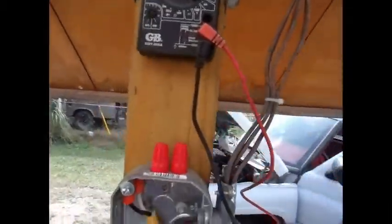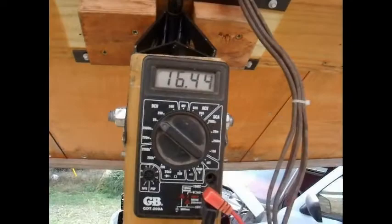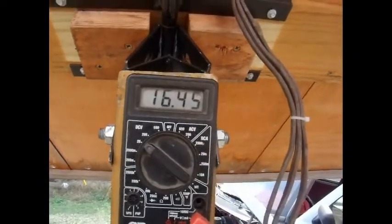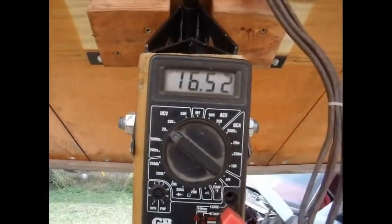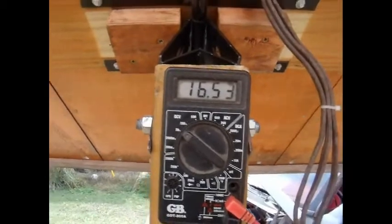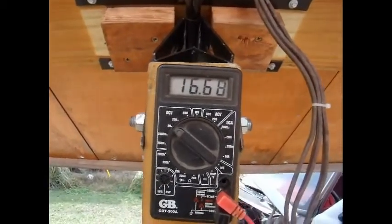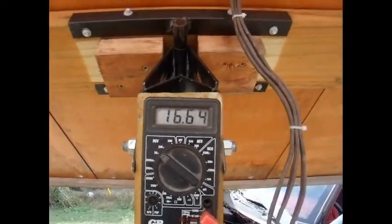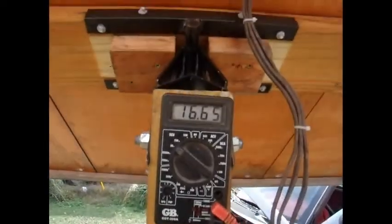Here's the backside of one of these panels. It's a little bit hazy today — the sun's in a bit of cloud right there. Typically it's 18 volts here, but some days even with no clouds it'll be 15 volts, and other days with no clouds it'll be 21 volts. So the output of the sun varies greatly from day to day, week to week — you've got to check it regularly. Right now this input is 16.6 volts, which charges the whole 12-volt system. It's the same thing the vehicle alternator would do.